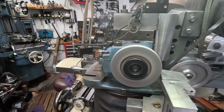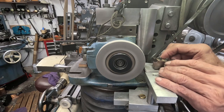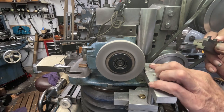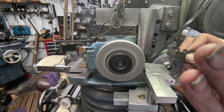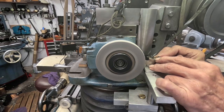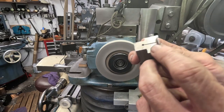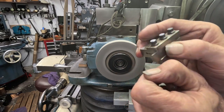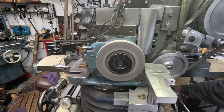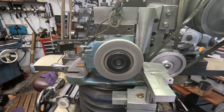I can flip the mic this way and lock the camera. This goes pretty fast — I can just lay it on there. This rest I can adjust. Being a high-speed steel tool cutting the oil-hardening drill rod I got over there, it's nice to be able to touch it up real quick, just like this. See it right there? Sharp. Okay. Power that down, get back over there, and do a thread test real quick.